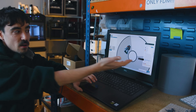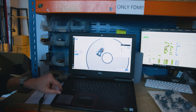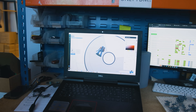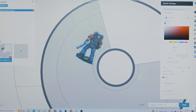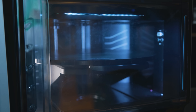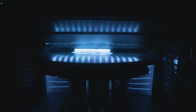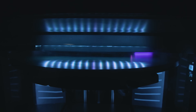Even on a small laptop, this slicing process was incredibly fast. Once that's done, you just send the print to the printer wirelessly. There are a load of options to choose depending on the materials the machine is using, but because this one is used in a production environment doing pretty much the same task over and over, we can skip all this. You can actually select the surface finish too — either satin or gloss, which is kind of cool. Once the model's on the printer, you just tell it to start the print. From here, this spinning plate will move upwards to what I'll call the printing components — there are multiple here. And as the bed spins, each of these components performs its particular task, though not all of them operate with every rotation — it's done in various stages.